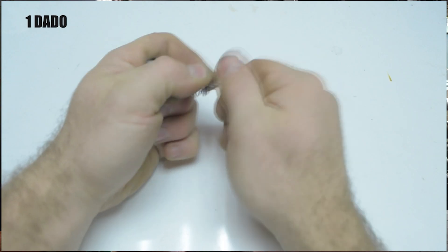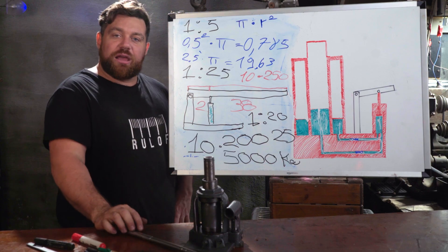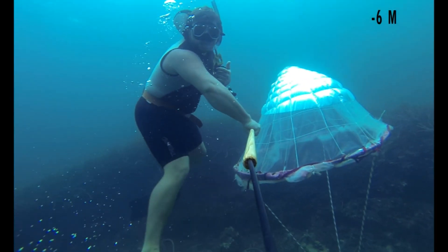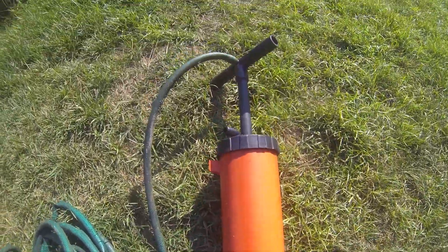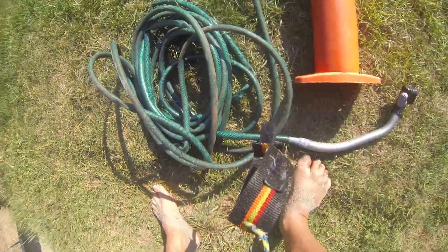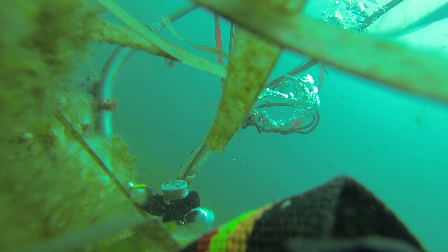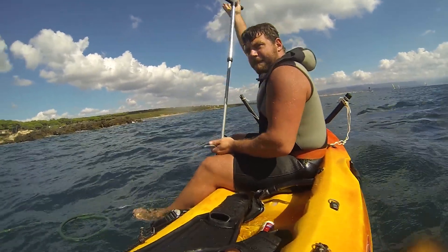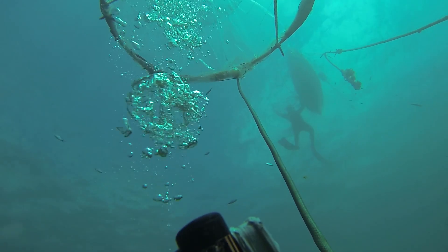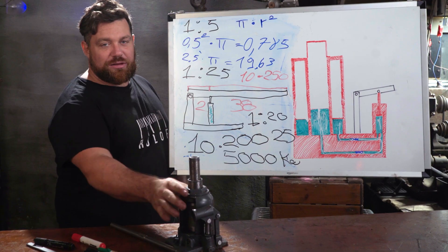It's also very interesting to see this pressure differential in real life. A couple of years ago when I started building my underwater scuba room, the plan was to use a huge pump to fill it with air, but you can imagine how much force you need to push against such a large surface area eight meters underwater - it was almost impossible. The solution was simply to change to a pump with a smaller diameter, making it much easier to push air underwater. This is something to keep in mind when doing these kinds of projects. I hope you enjoyed this video - please leave a thumbs up and I'll see you next week!